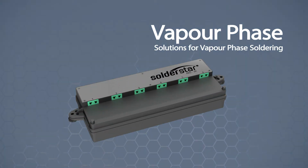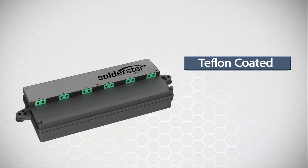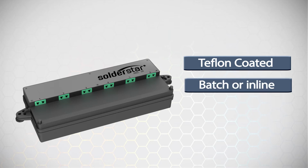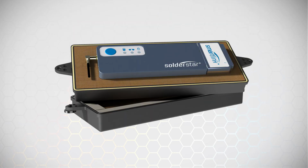The SolderStar Vapour phase systems are low mass and designed for minimum impact on the process. The shields are Teflon coated to resist Galden buildup and are sealed to prevent damage to the data logger unit. The system is suitable for use in both batch and inline Vapour phase machines and robust enough to even withstand processes with vacuum stages. The protective shield can be opened once data capture is complete, allowing the data logger to cool and minimize any chance of overheating or damage.